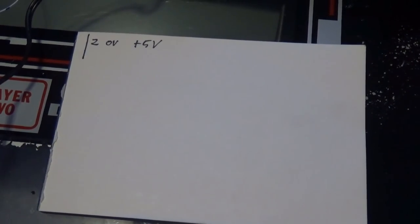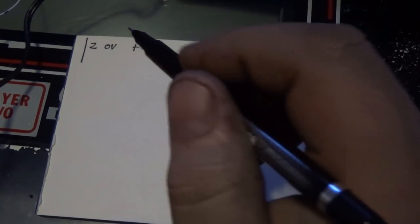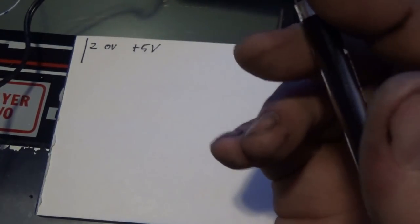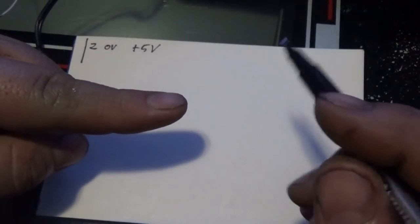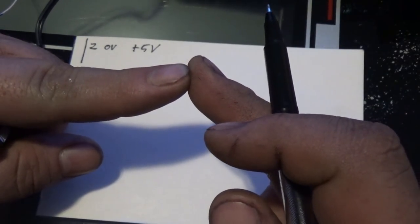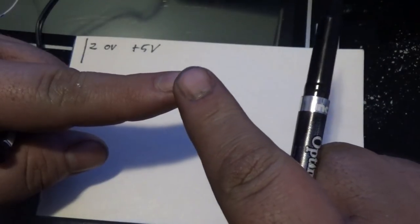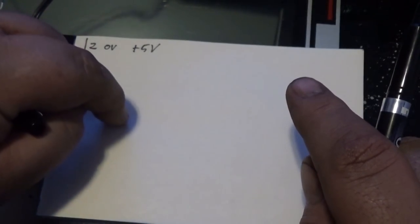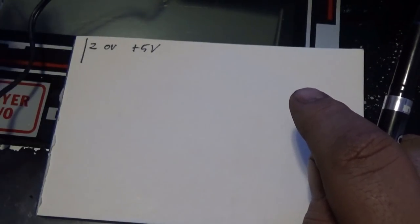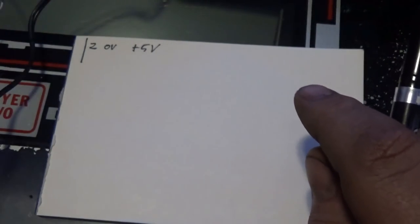Okay, I'm back. Well, anyways, let's say I have, I have no idea, 12 or 20 volts on the gun, and it's high all the time. Now, when the TV wants a beam, it'll hold that voltage down, and when the gun line is grounded out, it will produce a picture. Depending on how hard it's being grounded, that will determine the brightness of the picture.